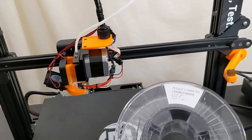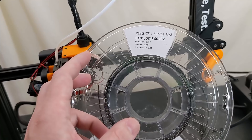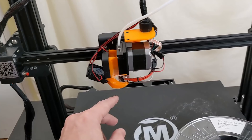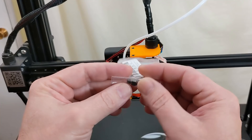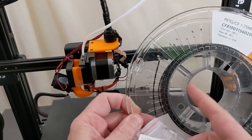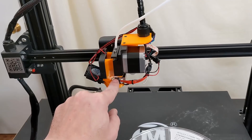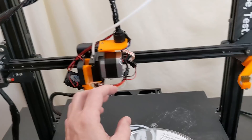I wanted to remove that possibility without having to dry my filament. Even if you dry your filament, you can still get those. The ideal solution would be dry filament, a really good slicer setup — get that file dialed in as perfectly as you can — and use the brush. I installed a high-carbon steel nozzle for printing the abrasive carbon fiber filament. Even with a user error where I leaked filament out the top of the hot block and it cooked for 20 hours, I still got a perfect print because of the brush.